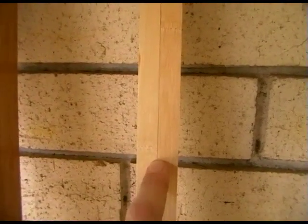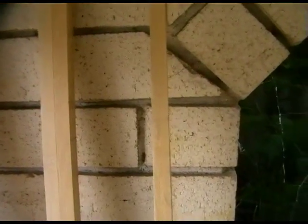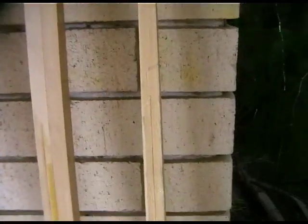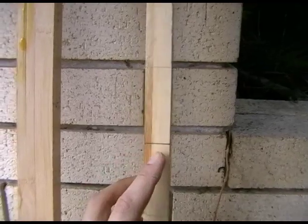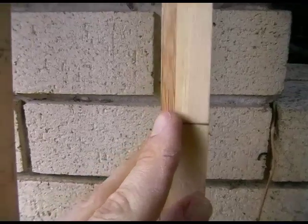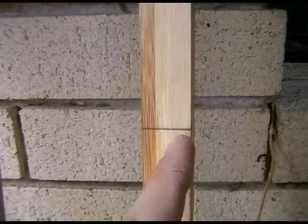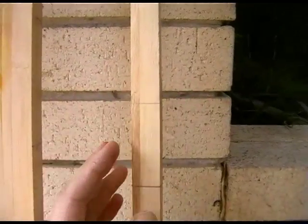You can see this is a lighter coloured board — this is the natural colour. This one is a sort of light cappuccino colour. Here's one I prepared earlier. This is looking at the back of a bow I'm just starting to shape for myself; I'm hoping to get to about 30 pounds at 28 inches. Here's the centre I've marked out. I've planed off most of one layer, leaving about 6mm as the back of the bow, and then this will be the belly. Obviously this is my handle area — it's going to bend that way, tapering up to the tip.